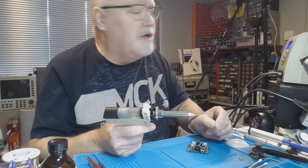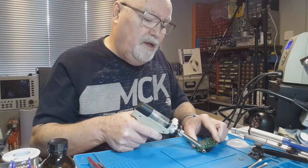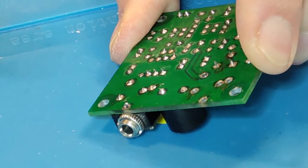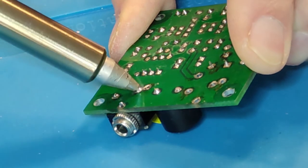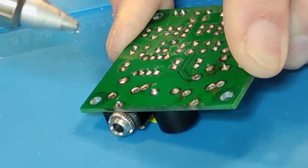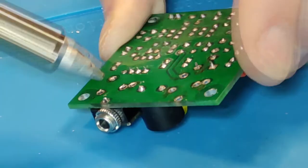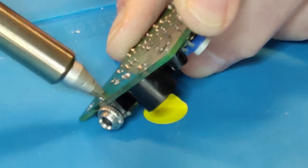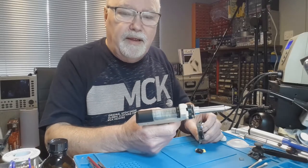It's up to temperature — currently at 340 degrees. I don't need my magnifying lens quite so much when I'm using this particular tool because it is very efficient. Put it on, give it a second for the heat to come up, and you can hear the compressor running. It is beneficial to actually work the component leg in small circles. You can actually see there — it's dropped out of the port without any assistance. Tremendous tool, can't recommend it enough.